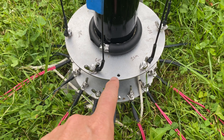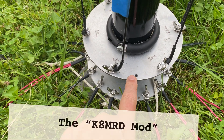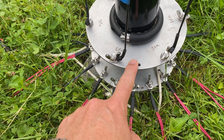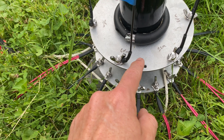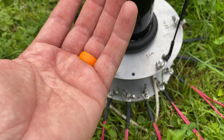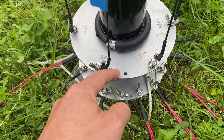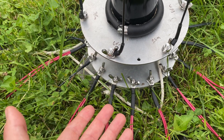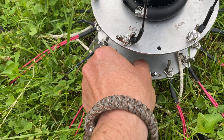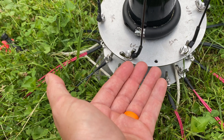Another possible change: I may add a dedicated 10-meter element here. Not sure if I'll make it a quarter-wave or five-eighths — it's worth experimenting. It's not that difficult to put the mast down and back up, so why not test it? Part of this hobby is experimentation to figure out what works best for us, and I have the opportunity without damaging anything else.